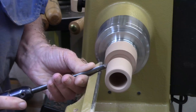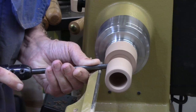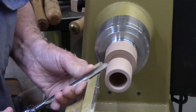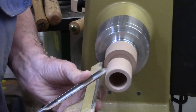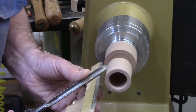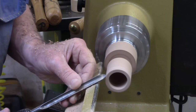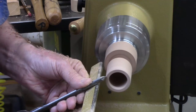I just need to have a little clearance back here. The wall thickness is a little thicker than I need, so I'm going to take a planing cut and take it back a little bit, get rid of that bandsaw mark on the side. It's chattering a little bit because there's not a lot of support, so I'm going to go ahead and just chamfer the edge — I can't come back in this direction anyway.